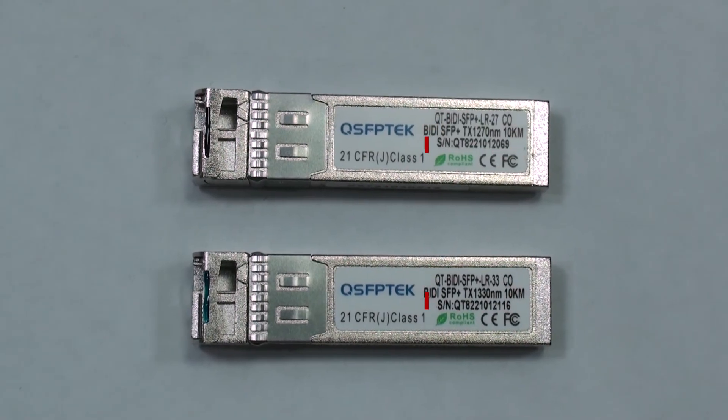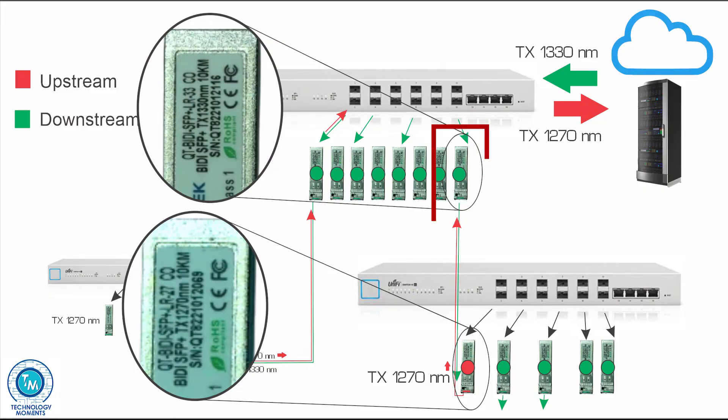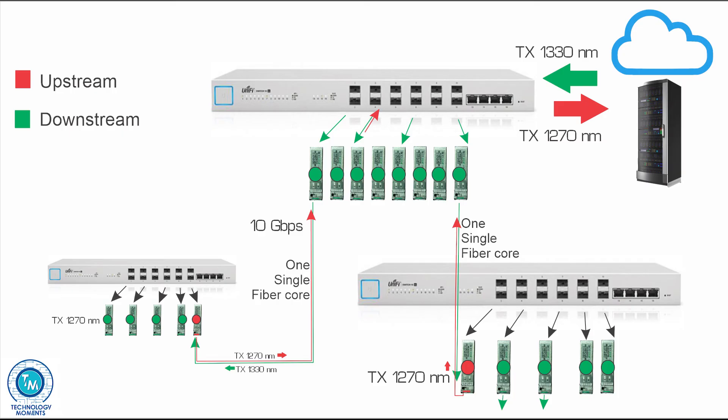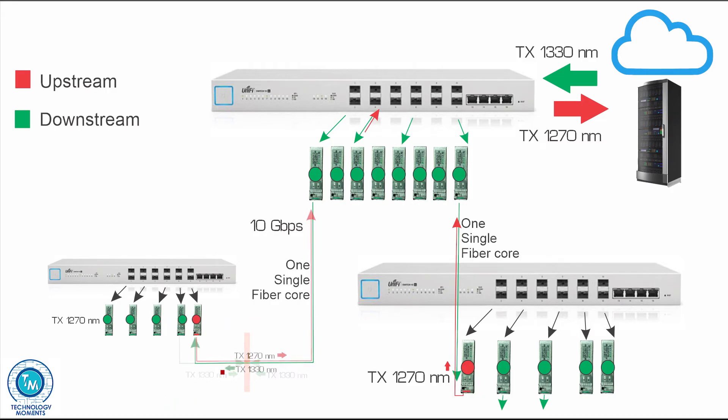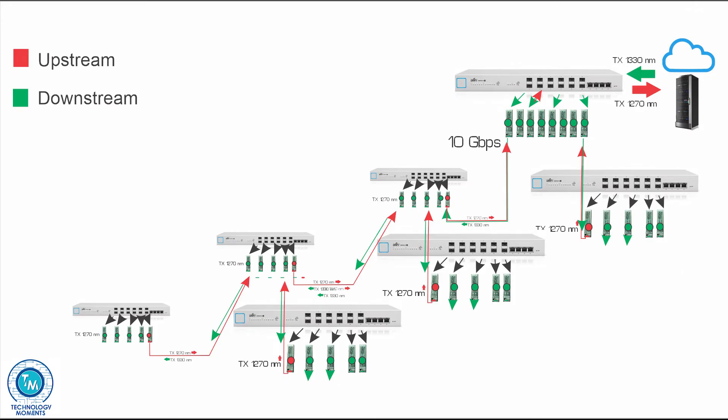This way, you can exchange them easily. Switches downstream are going to transmit with the specified module, and if you make the mistake of connecting the same colored modules, you will not get a link and might get confused. Typically, it has been chosen that SFP modules are going to transmit upstream in the shorter wavelength, but there isn't any technical reason why you should do that. The importance of doing this is basically organization and understanding that if you are going to send information in one direction, the other end of the cable run is going to understand the signal being received.